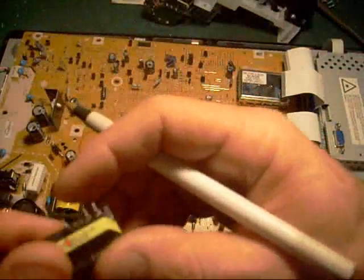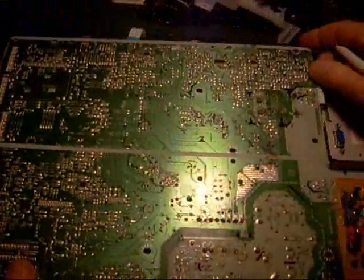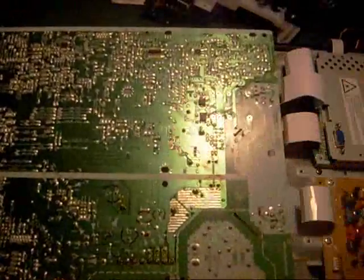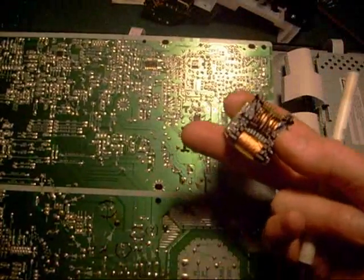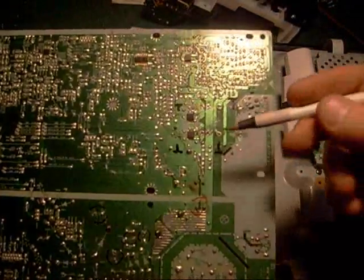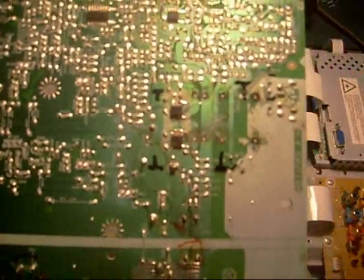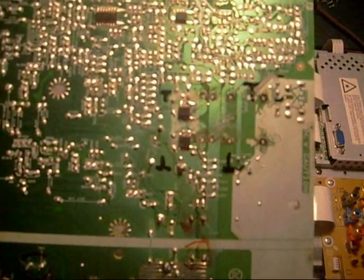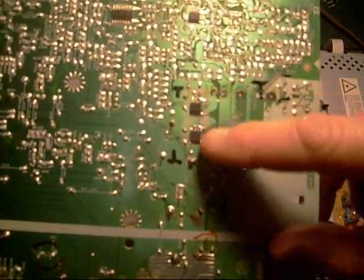The transformer checked okay, but strangely enough, as soon as I removed the transformer, my standby voltage returned to normal — up to 3.5 volts. That could be misleading; by pulling it out you'd assume that's the cause, but not necessarily. These two MOSFETs here that drive the transformer had actually gone bad. When I put the transformer back in and removed the MOSFETs, the standby voltage came up to normal. So I figured that was probably the problem.